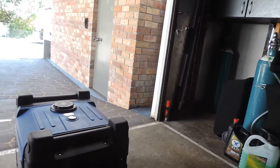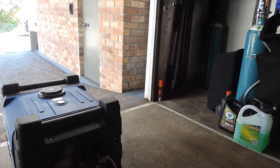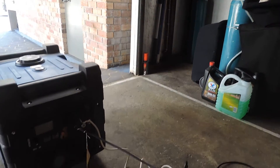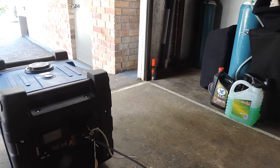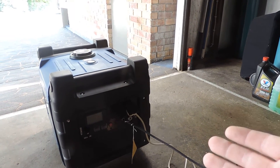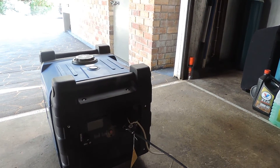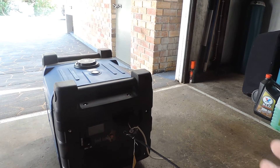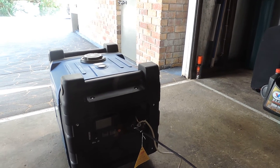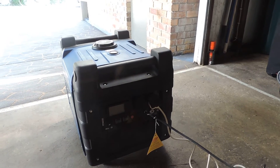At 3,300 watts, you turn a 500 watt element on again and it just trips out straight away. So it's only doing approximately 3,600 watts maximum capacity before it trips out and saves itself. Which, to my understanding, that's only the capacity of a 5 kVA generator. And that's exactly the same specifications as listed in all the 5 kVA generators all over the internet. And yet you guys are claiming this is a 7 kVA, but it closes down at exactly the specifications of a 5.